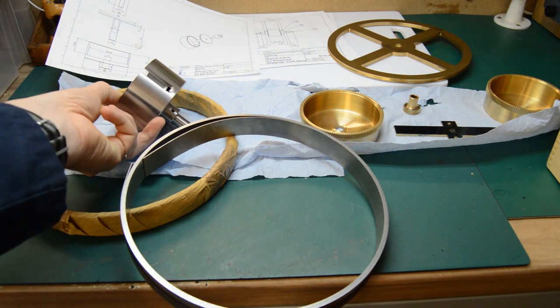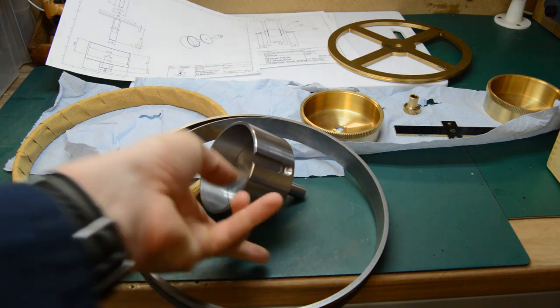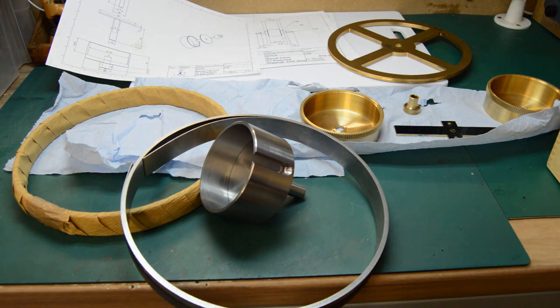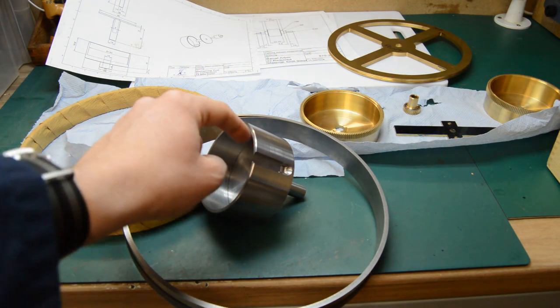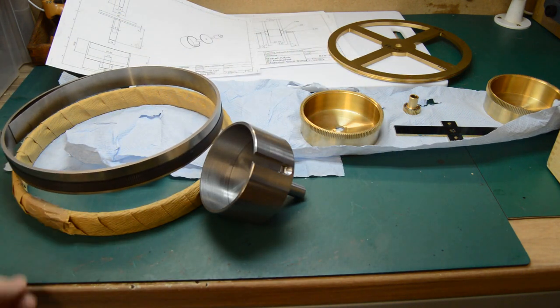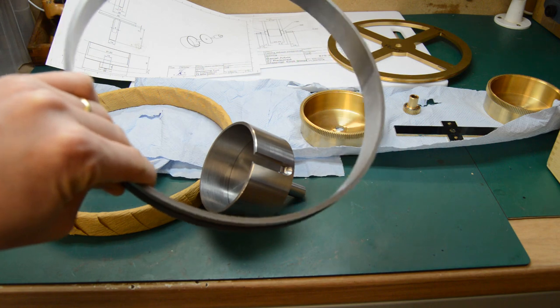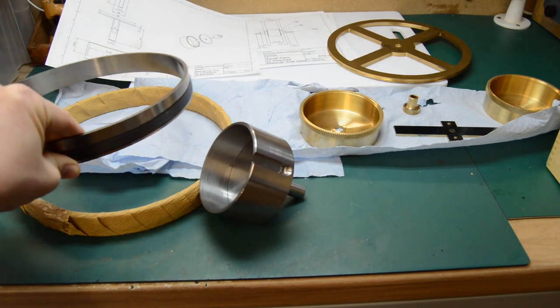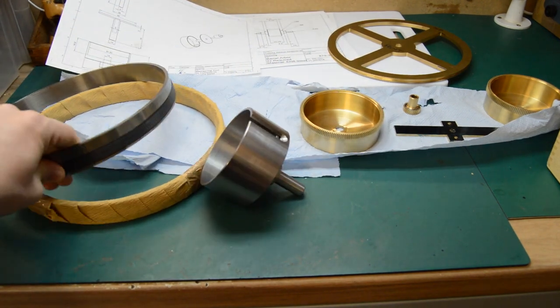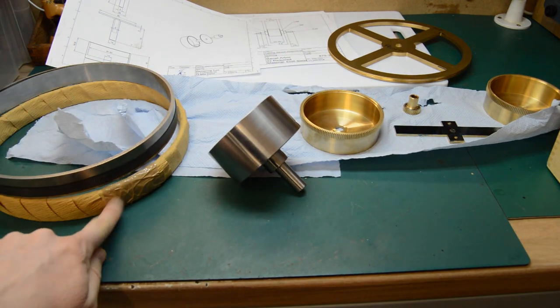We will then use a specially made large size tool for the Bergeon mainspring winder, and winding the spring into this will hopefully cause it to hold the shape of a mainspring. They will be quite strong springs. I think from memory this is 0.55 thickness, which for the size of barrel means there's going to be quite some power involved in that. So there are two mainsprings here.